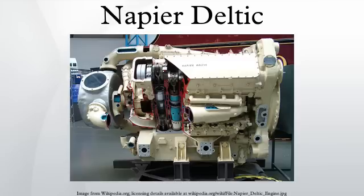Proving successful, Deltic diesel engines became a common power plant in small and fast naval craft. The Royal Navy used them first in the Dark-class fast attack craft, and subsequently in a number of other smaller attack craft. Being largely of aluminium construction, their low magnetic signature allowed their use in mine countermeasures vessels, and the Deltic was selected to power the Ton-class minesweeper. The Deltic engine is still in service in the Hunt-class, with these versions derated to reduce engine stress. Deltic diesels also served in MTBs and PT boats built for other navies, particularly the Norwegian Tjeld or Nasty-class, which was also sold to Germany, Greece, and the United States Navy. Nasty-class boats served in the Vietnam War, largely for covert operations. Smaller nine-cylinder Deltic-9 engines were also used as marine engines, notably by minesweepers.